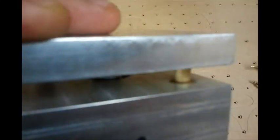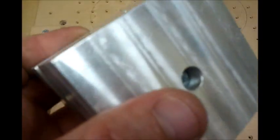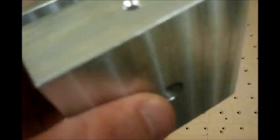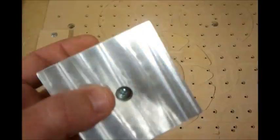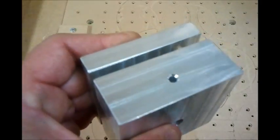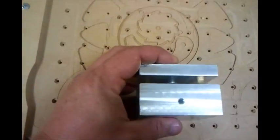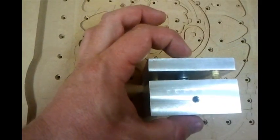It's got a couple of brass rods that go in bronze sleeves, with a spring in the center. On the bottom there's a counterbored hole with a screw in it which threads into the top plate only — it's a through hole in the bottom which allows it to slide. This also allows you to turn the screw and set the overall height of the block.